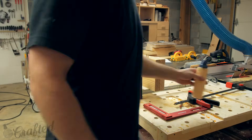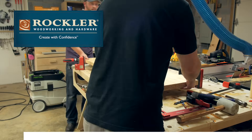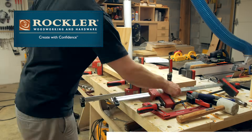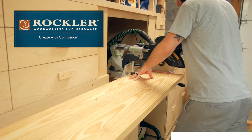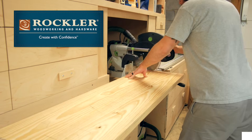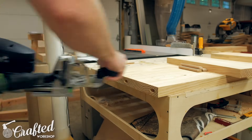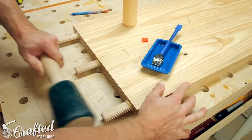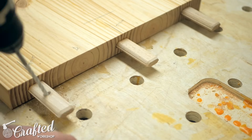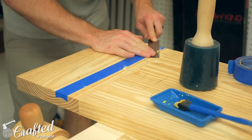While we're gluing up the tops, let's talk about the other sponsor of this week's video — Rockler. I used a ton of Rockler products during this build, including their dowel drilling jig, glue application master set, and their tabletop fasteners. Rockler has got tons of great tools and accessories for your next build, and they're always coming up with new and innovative ideas that help make your woodworking both more efficient and more enjoyable. After the glue dried on the top I squared up the ends on the miter saw and then installed the breadboard ends just like I did on the tabletop, again with dominoes, draw boring the ends into place. I tried to use quarter-inch dowels on one of the benches but they proved to be too small to survive the draw boring process, so I'd definitely recommend a minimum of a 3/8 inch dowel.